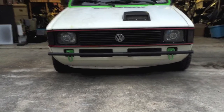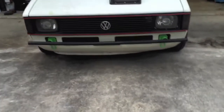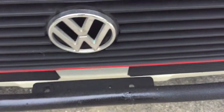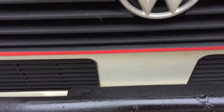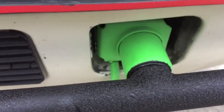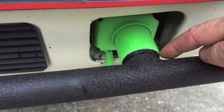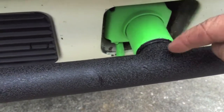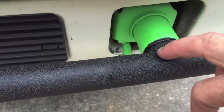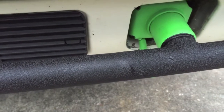I put a bend in the pipe to match the front of the car and it came out real nice. I put a little tab there at the bottom so I can mount some lights in the future — there's more clearance than it looks like, enough to mount two six-inch round lights. There are the original Cabriolet shock strut mounts — I cut them off up here, then scalloped that out with a grinder. There's a weld bead running in there that you can't see underneath the crinkle coat. Bought a can of crinkle coat at NAPA, came out pretty good.